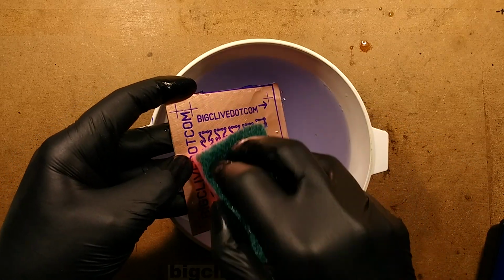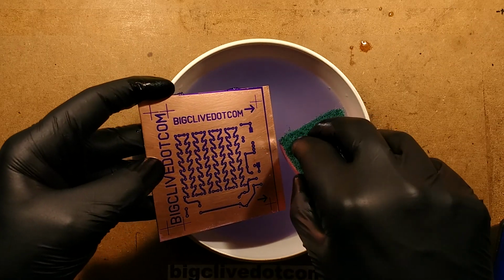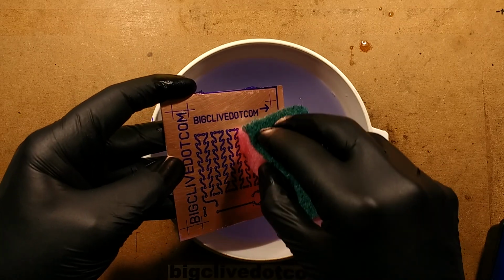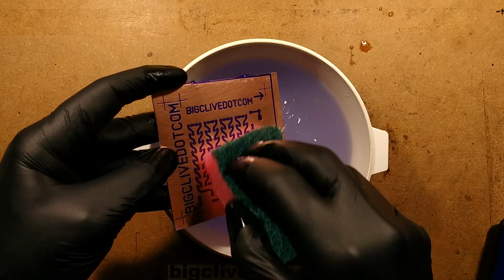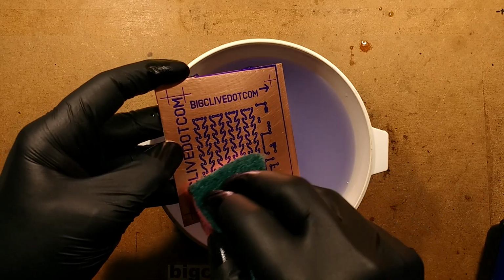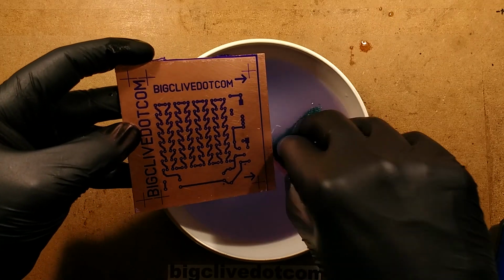Now, didn't Sinclair, they did a system whereby you just actually had sponges with the chemicals loaded and you used them like this, where you didn't actually dip it in liquid at all. It was purely done with a sponge, not just for putting on the ultraviolet photoresist in the first place, but also for developing it, possibly even etching it as well. This is looking a lot better now.